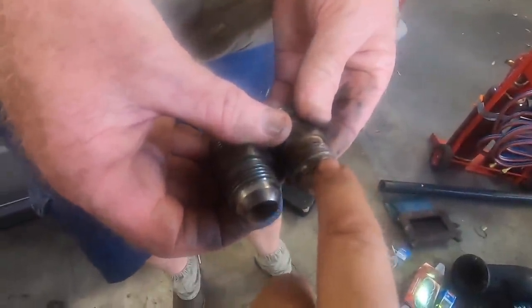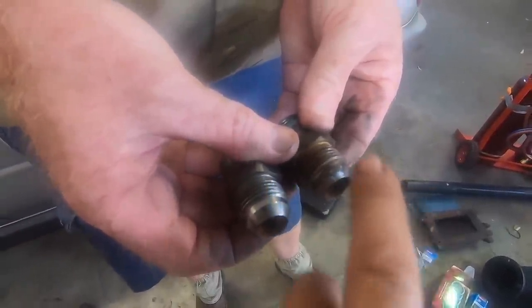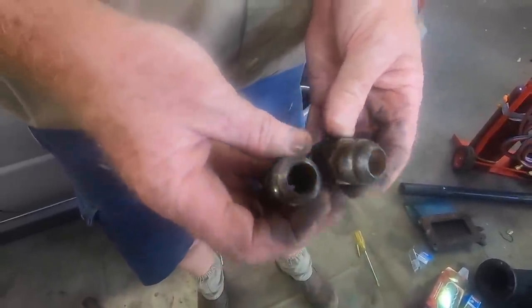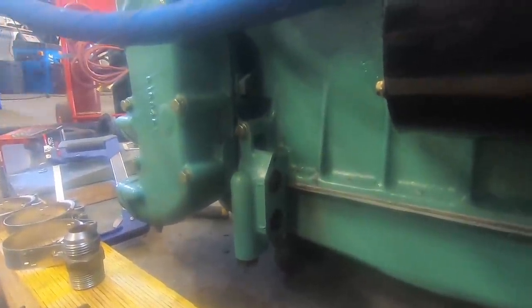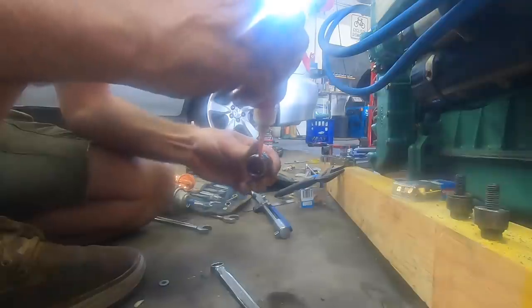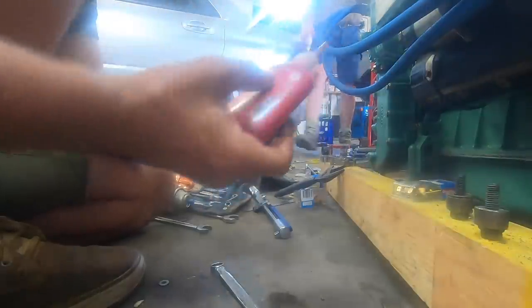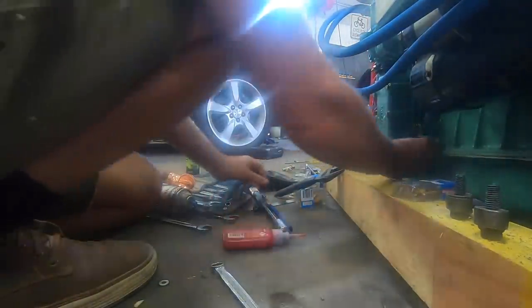Pete had given this one a hand brush in situ and then decided it wasn't good enough, rightly, took it out, put this one on the wheel and is going to do the same for this one, so that'll be heaps better. There are our inlet and outlet ports for the oil cooler, heading off to the oil filter. So a little bit of sealant on them and installed them. It actually turned out to be easier to do one at a time completely, just so they weren't in the way of each other.